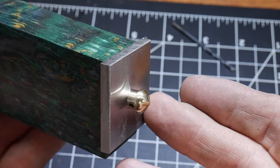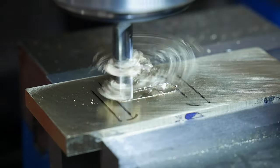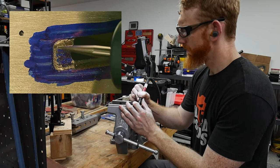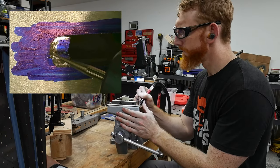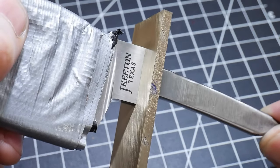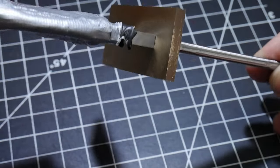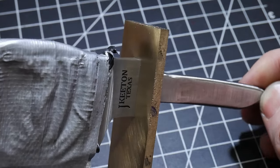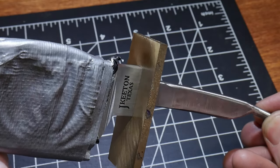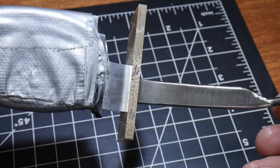The bronze bar stock I have is a little thick for this application so I took it down to around 190 thousandths of an inch, then milled the slot in it with a 3/16-inch end mill. Using a high-speed carbide burr and my cheapo digital microscope I repeated the process of the guard fitting. This guard fit isn't perfect but it's better than the last 3 attempts with this knife. After reflecting I've concluded the issue lies in the slot itself — I think for all 4 guards I enlarged the slot too tall with my files, allowing slight movement perpendicular to the edge. After a few cycles of hammering on the guard this results in little gaps at the top and bottom of the ricasso, compounded by issues with my shoulder dimensions, back-cutting, and the softened ricasso.